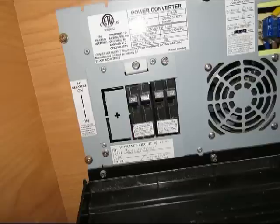that just screw in. The black power wires actually go down to the circuit breakers, so you can't get to those, but you have to unscrew all those neutrals and ground wires, and then you can go down to the circuit breakers and start at them. Circuit breakers are on the front. You take the cover, there's a cover over the circuit breakers, off.